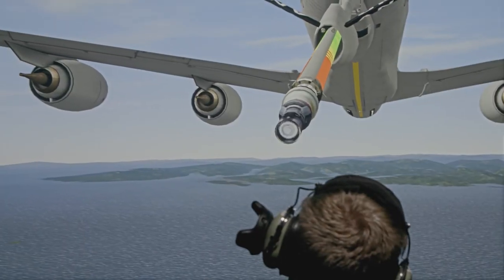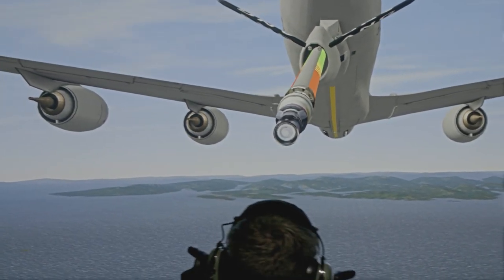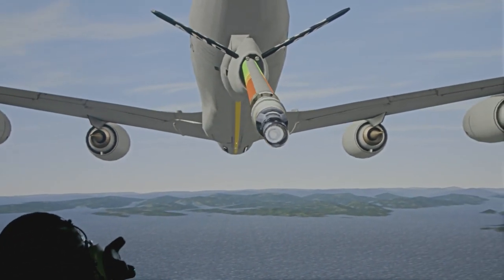The combination of these improvements facilitates detection, orientation, recognition, and identification, otherwise known as DORI, tasks during air-to-air or air-to-ground combat. Now, let's view the scenario in e-collimation mode. E-collimation corrects and virtually eliminates parallax error caused by head movement. As the pilot moves his head, the image changes to match his viewpoint, and the heads-up display stays aligned to the pilot's viewpoint.